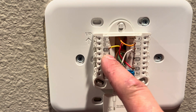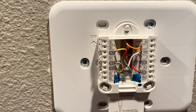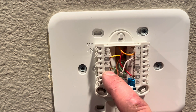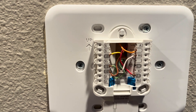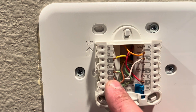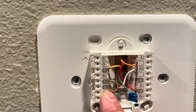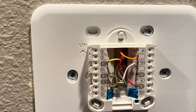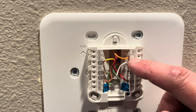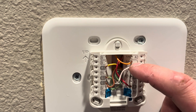Right here we have yellow — that is the cooling wire, we're going to put that on the yellow terminal. Green wire is wired at the air handler; green is for fan. Common wire — there's a C here — we are using the brown today for the common wire that runs back to the air handler.